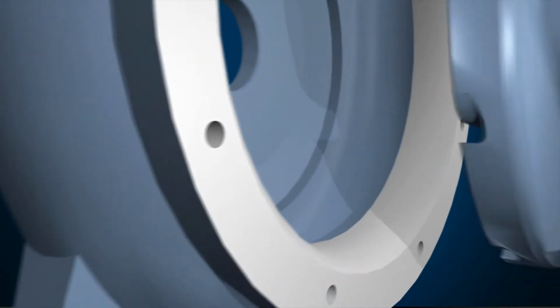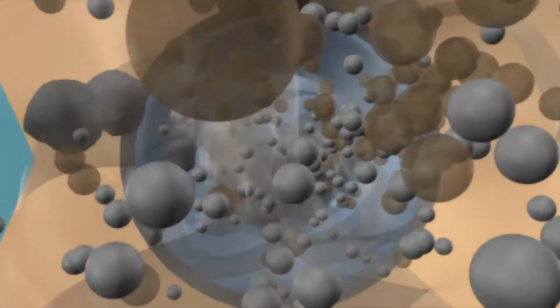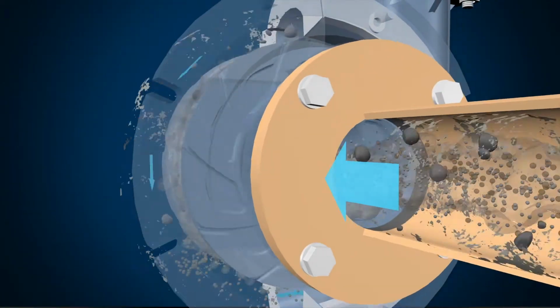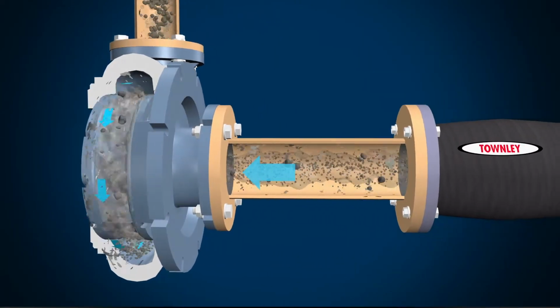The efficiency of the UBD pumps or any other pump is really a function of its geometric design, how the geometric design is matched to the actual operating criteria. And in looking at that, one has to look at velocity distributions within the impeller, velocity distributions within the casing, so they all have to match. Fluid enters the pump at a given velocity, which depends on the flow rate, gallons per minute, in a given size area. So we need to have a smooth transition of velocities as the fluid enters the impeller, exits the impeller, enters the casing, exits the casing.